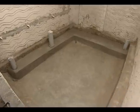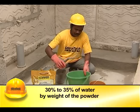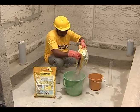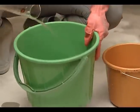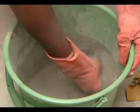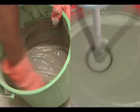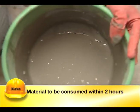The surface should be dried before application of the product. Ultratec seal and dry requires 30-35% of water by weight of the powder for making a good application mix. A small quantity of water is to be poured into the mixing container, followed by seal and dry, and then the remaining quantity of water. It shall be mixed thoroughly to get uniform thick slurry, preferably by using a mechanical stirrer. The material should be consumed within 2 hours.